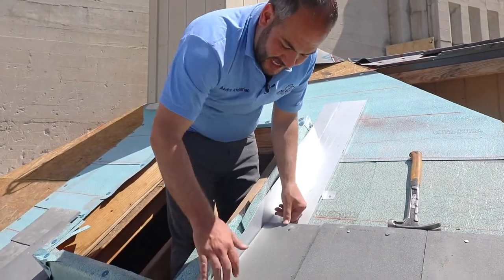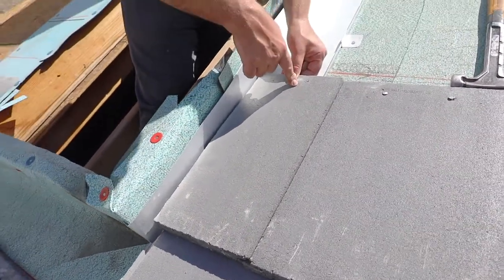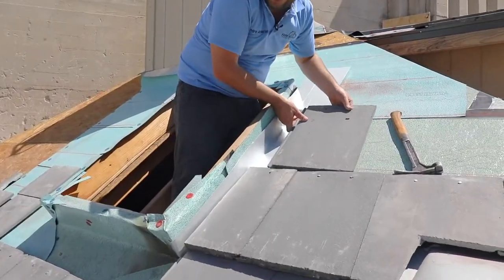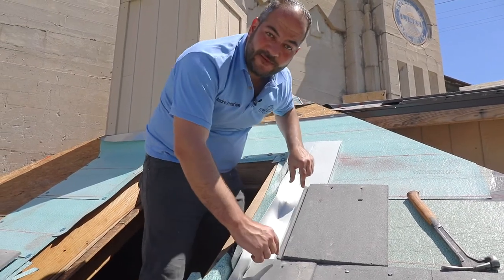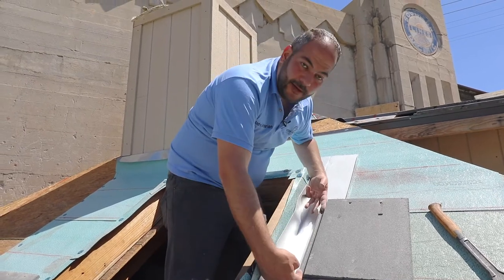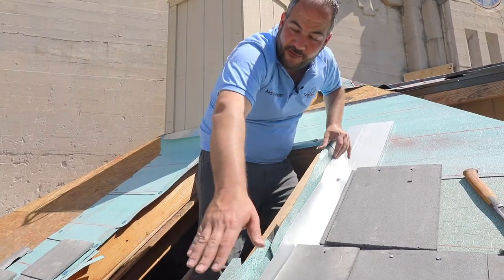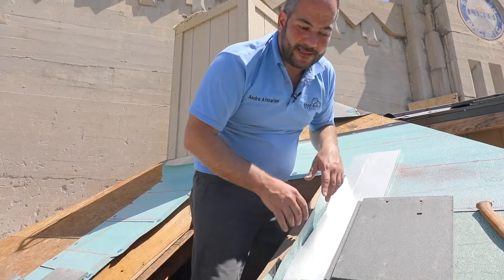You can see we've got this tile cut down to size. You don't need to be perfectly all the way butted up against here — you can leave a quarter to half-inch gap. Again, one thing we want to be sure of is we're not nailing in this hole right here; we don't want to nail through the tile pan ever. What we want to do is just create a hole right here. If you had a small strip, you still don't nail it down — what we want to do is cut that narrow strip of tile down and actually glue it, whether caulking or mastic. It's a lot better for that tile to fall out because really this tile is not doing anything as far as waterproofing goes — it's just aesthetics to cover up this tile pan. All the water would get in here and travel off the roof, so we don't want to make holes here. If you do have small strips, use glue and adhesive to fasten it down instead of nails.